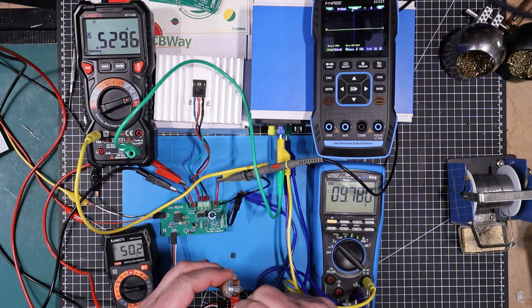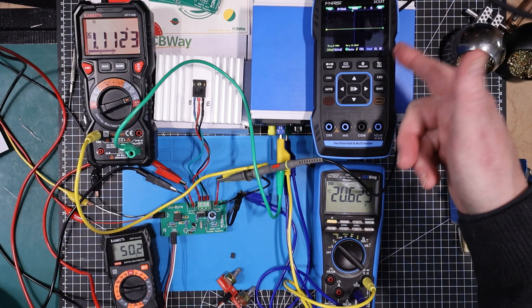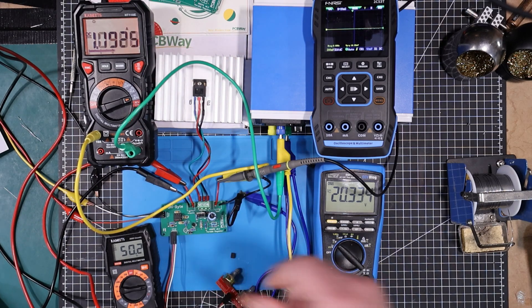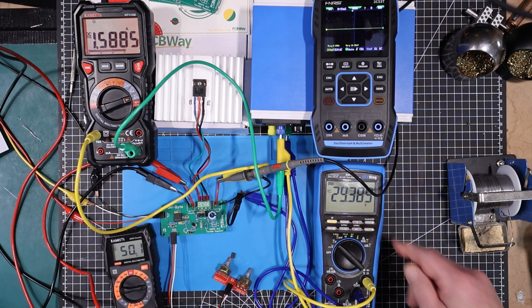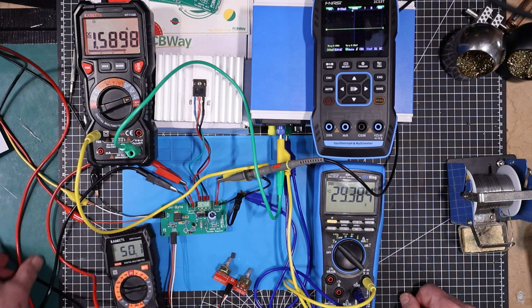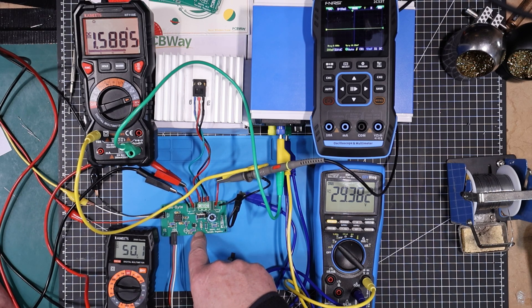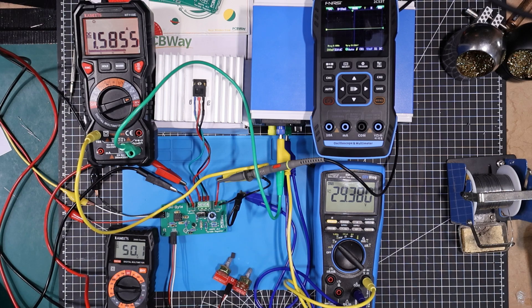All right, let's bring it up to the next step. About 20 volts, about an amp, 50 still — no noise, 8 to 16 millivolts bouncing back and forth, same as when it was off. Okay, this is definitely getting warm now. Let's just crank it all the way up and see if we can let that smoke. So basically 29.4 volts — pretty close, within the tolerance of the resistors. 1.6 amps, still no noise of any kind, and we get a little voltage drop over the wires. I want to check for a couple of voltages: the reference, the base of this transistor, and then the dropout voltage. Let me set up for all that and we'll come right back.